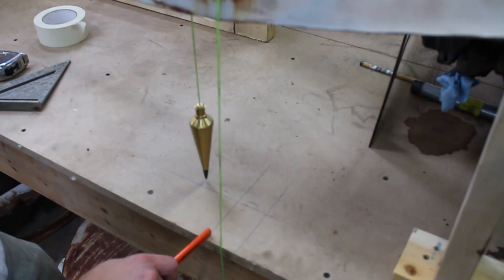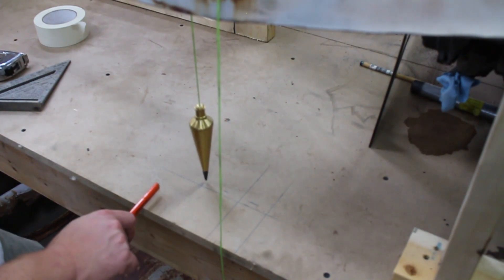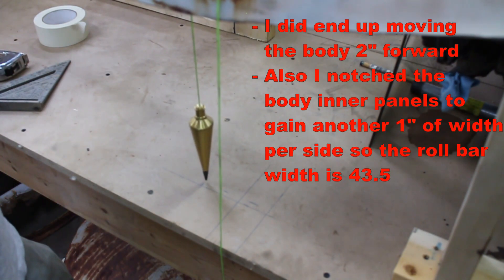On the model, I had wanted that to be 33 inches from the back. If that's 28, it looks more like it's 31 — so it looks like the body is actually about two inches further rearward than what I wanted. I'm going to check into that and I might end up moving the body forward a couple inches, because that's important for the front end to have a long enough front overhang to get the suspension in. The back I'm extending anyway, so it's less important that the back be exactly on.